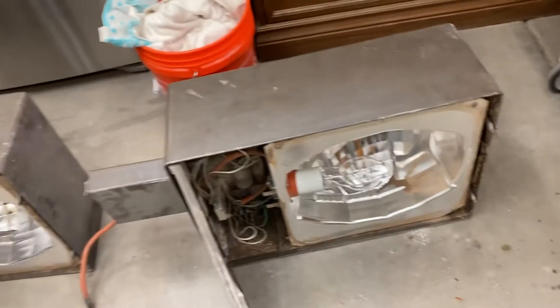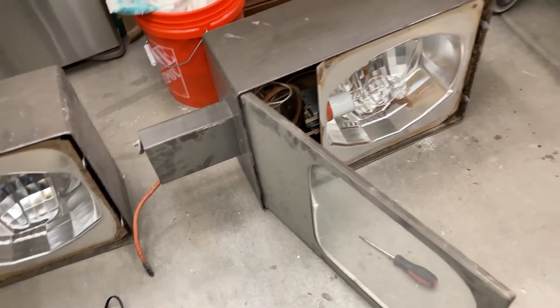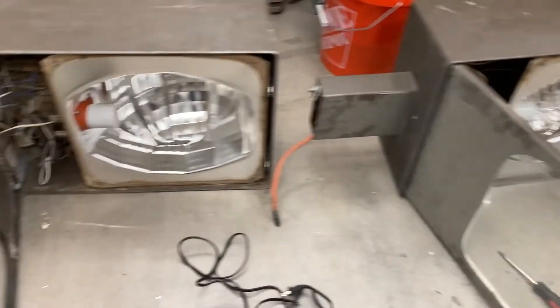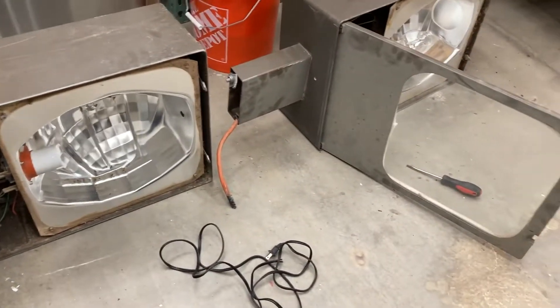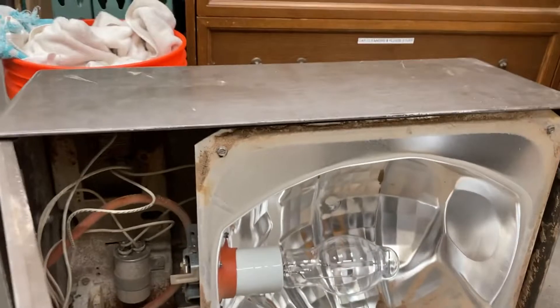What I'm going to do next — and I'll probably divide this into two parts — is splice a power cord into one fixture at a time. I have a chopped-up power cord from a lamp and I'll splice it into each fixture just to see if they're in working condition. I'm also going to hook up a ground fault circuit interrupter in between so that if there's a nasty short it trips immediately and we don't start any fires.